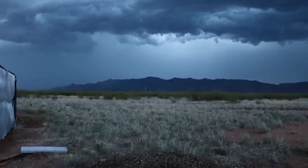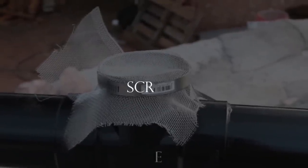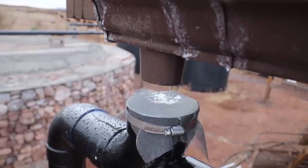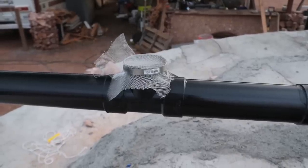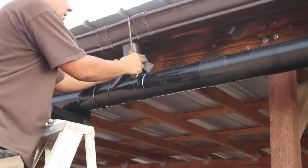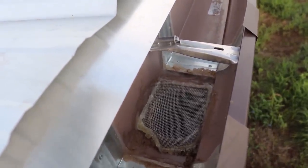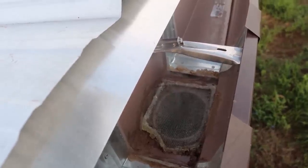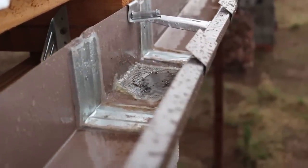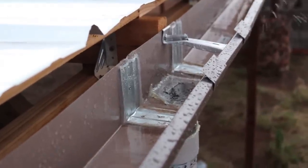First up are the screens. In any rainwater harvesting system it's a good idea to screen any downspouts, vents, or openings — you don't want debris or insects getting in there. Screens on any openings are incredibly important. The first time we set up our rainwater harvesting system, we put screens right on top of the openings of the gutters. Although that would keep debris out of the pipes, having the screens right on top of the gutters caused issues because those screens get dirty fast.